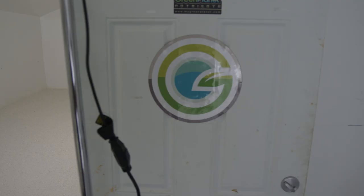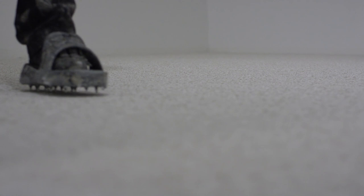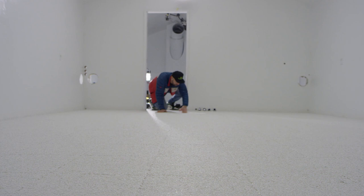Can you adhere a product like this to wood? Yeah, no problem. So I understand we didn't go with actual epoxy — tell us a little more about poly. Both are great products. The big thing for me using poly in this situation is that it's UV stable. Especially with this room, with the lighting and everything, it was key that we went with the poly for the UV part of it. What happens if you use a product that's not UV stable? It will just start to yellow. So just to keep that floor clean and as one piece rather than it being yellowed by the lights — this way it's just one sheet of white. We chose to go with white obviously for reflection, and that makes a big difference. The biggest thing is the cleanliness — that you're able to see it, clean it, there's nothing hidden. But I've had a lot of great feedback on what it's been able to do for the plants, just the way it seals it and the reflection off the white.